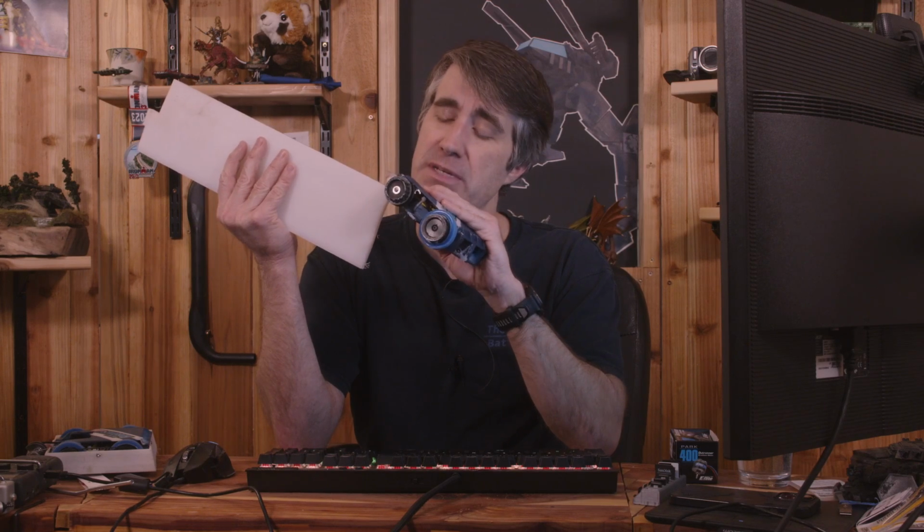Also, as a bonus, UHMW is about 80% as dense as polycarbonate, so I can get away with either adding more material to my weapon cage pieces, or I can increase their thickness to make their durability a little bit better.